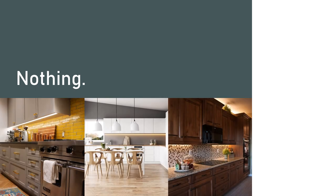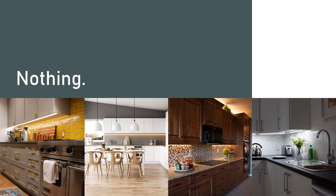There is nothing like under cabinet lights to absolutely set off a kitchen. There is nothing in the electrical industry that gives you that 'oh' moment like the first time you flip on some under cabinet lights, especially in a really dark kitchen — it can really bring it back to life. But we're asking the question today: where can I get that power from? Can I pop off the countertop receptacle? And the answer is no. Let's go down that code road quickly.